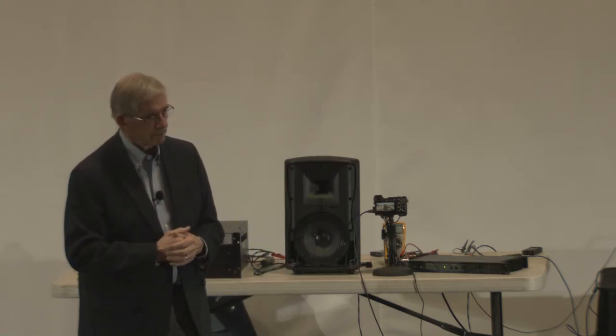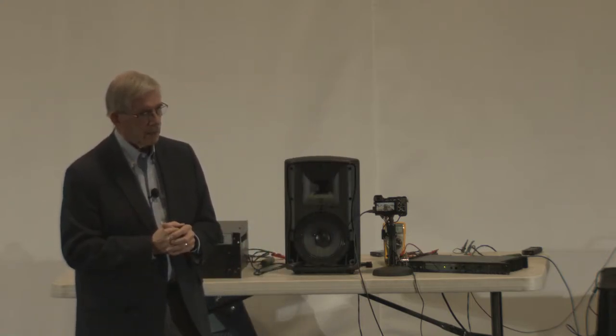Like I say, we have a whole session on just setting gains. And so the amplifier is just there to, ideally, you would plug a mic into the preamp. The mic preamp clip light would come on at the same time that the output meter reads red, at the same time that the amplifier clips. That's the ideal situation.